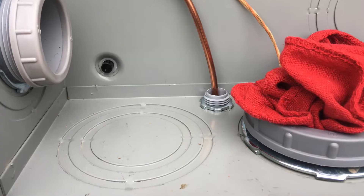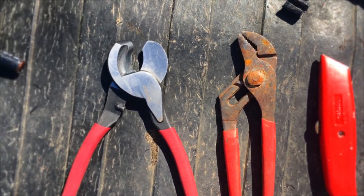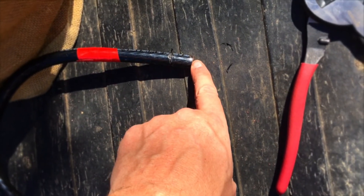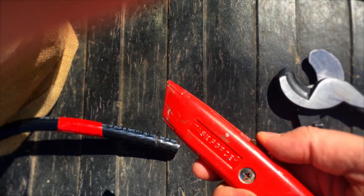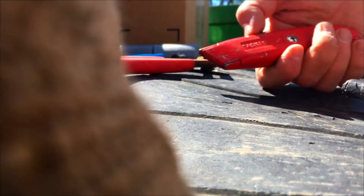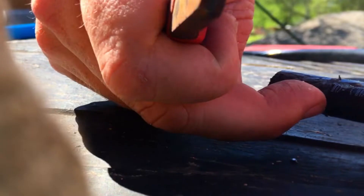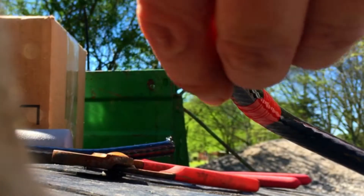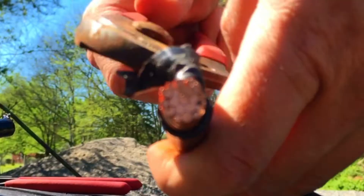We're using number four bare copper, and four wires are actually running to the building so that our building will be sub-panels. Here's my method of stripping 3-AWG copper — it doesn't have to be pretty on the outside as long as you don't injure the copper inside. I use these cutters to score the outside in a straight line, scored all the way around and along the side. Then you just rock it a little bit and it breaks away where the score happened.